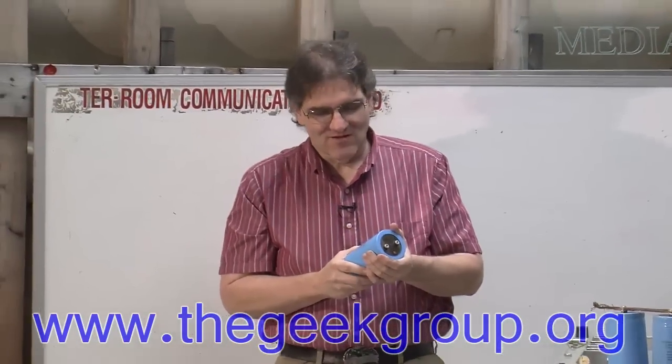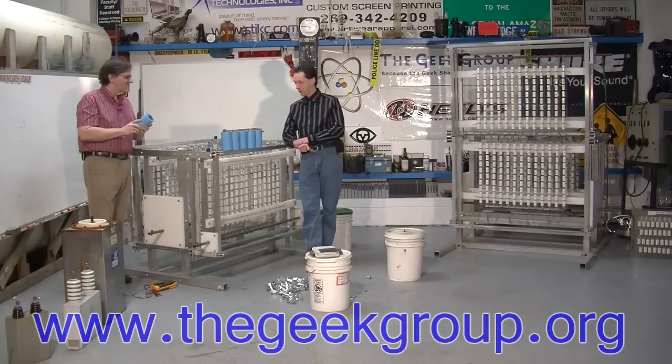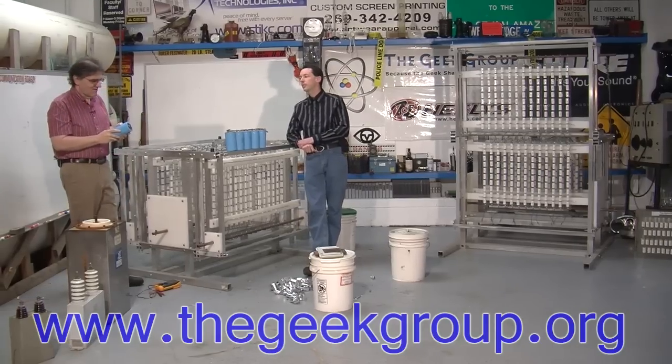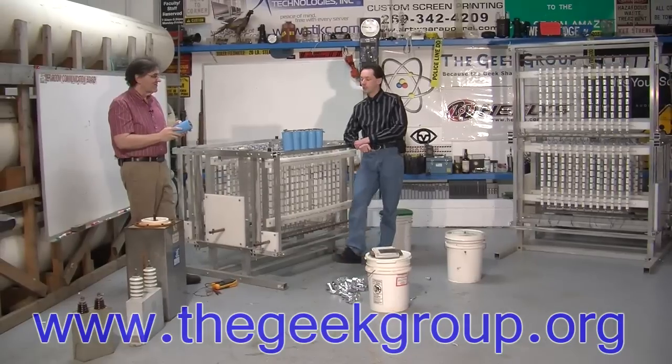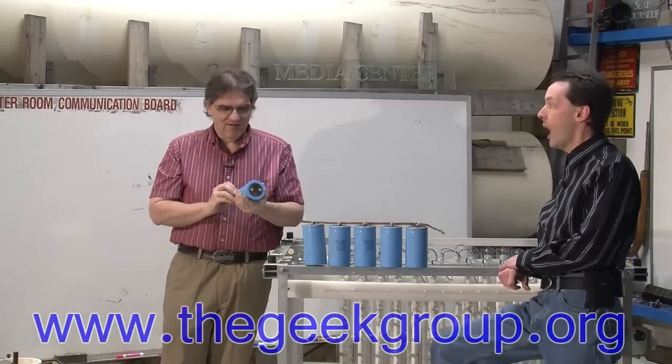Usually, sometimes we add or remove a drawer, but usually it's 200 caps. These are Cornell Dubilier? Yes, Cornell Dubilier. Those are 450 volt, 2,000 microfarad. And they're inverter grade, which means they're the hoo-ah caps.